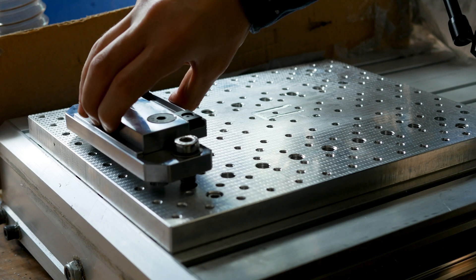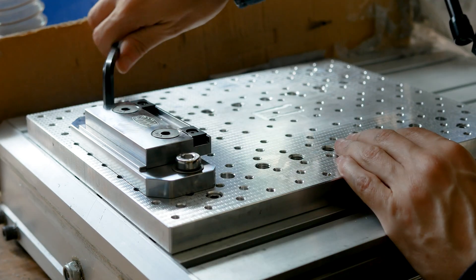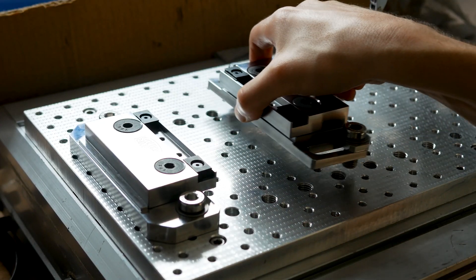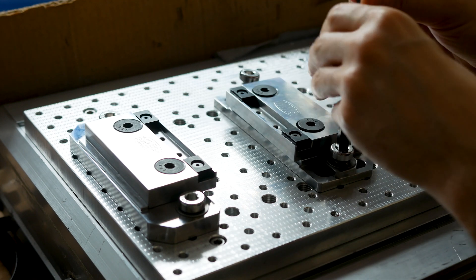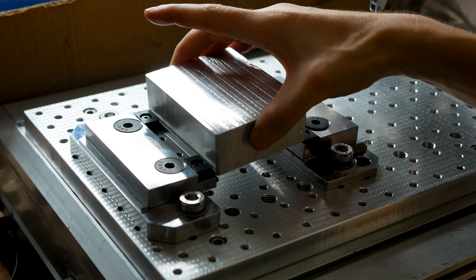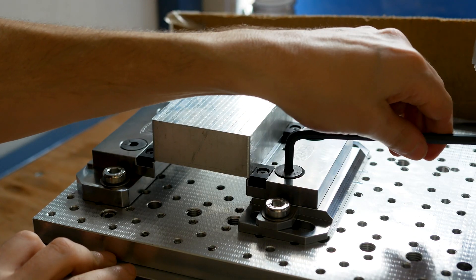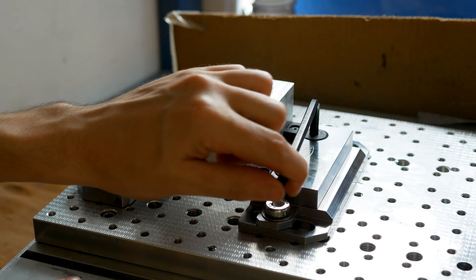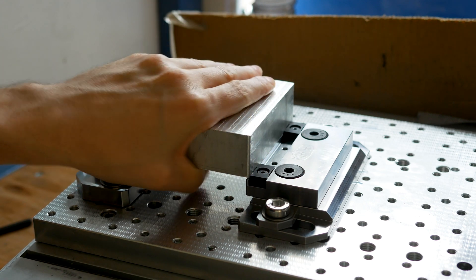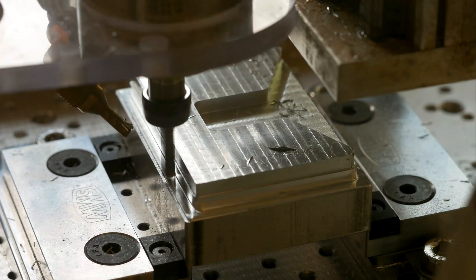Next it was just putting in an M12 thread into each of these holes. You can see how it works — those diamond pins will just position this back piece of the vise. And as you can see, my indicator shows that it's pretty much spot on. With just a third to half of a turn you can see that it really clamps the piece in well. Then I just machined this part — it's going to be part of an upgrade for the screen printing squeegee arm that we made a few weeks ago.